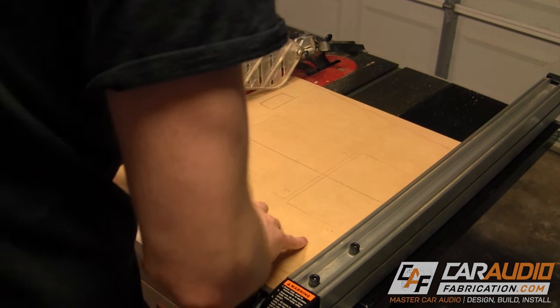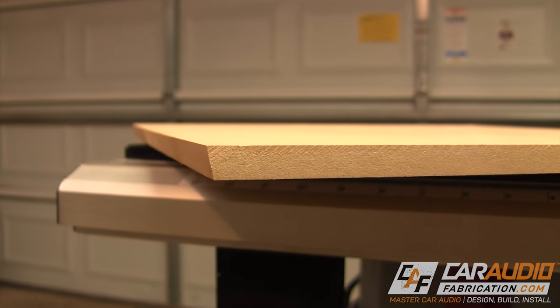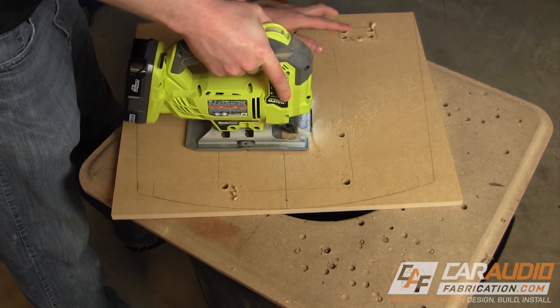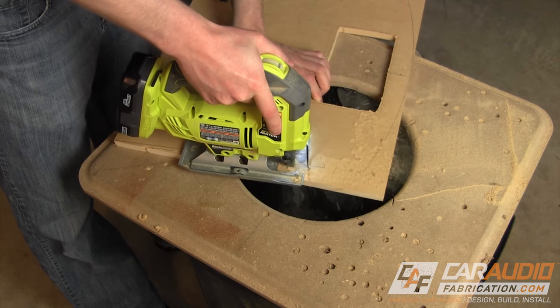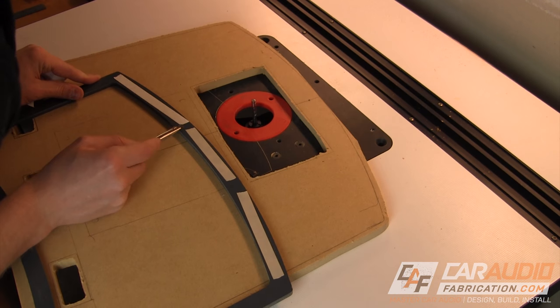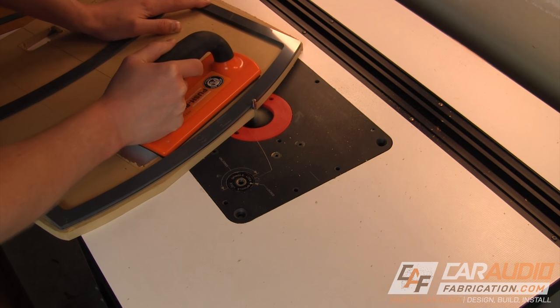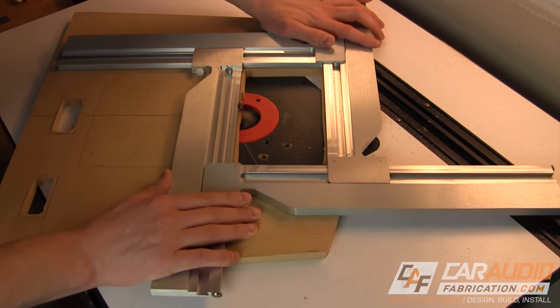After sketching out the locations of everything and the overall shape, I make an angled cut on the bottom so that the face will sit at an angle. I rough cut everything using a jigsaw, then use templates in the router with a flush trim bit to make sure that my final cuts are perfect. I apply double-sided template tape to a mobile solution smart template to copy the outer profile shape, and for the radio hole, I'm using the Fukuda square to cut out a perfect rectangle.